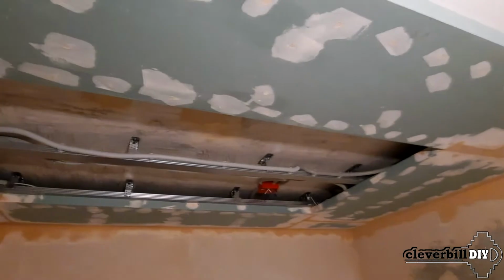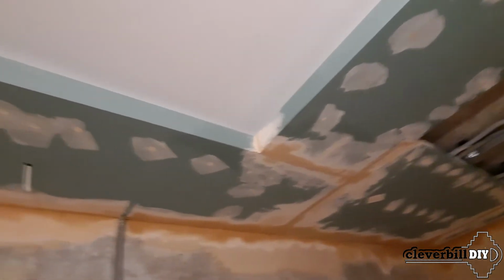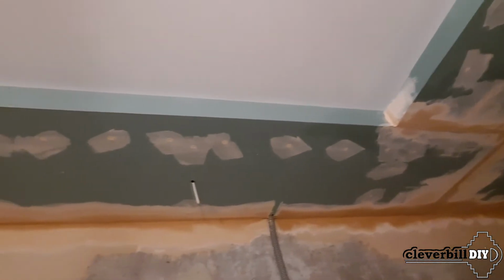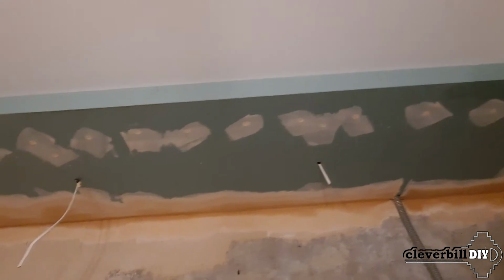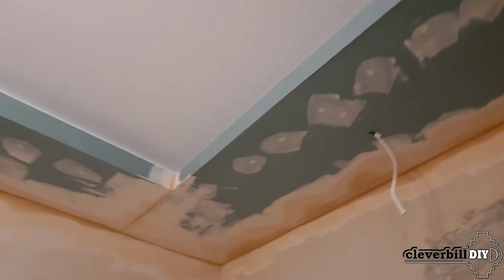In this situation, it was decided to reinforce the plasterboard ceiling of the second level, consisting of many parts and having a large number of joints, with a glass mesh. To reduce the time and exclude one operation, the glass mesh was installed directly on the putty layer.